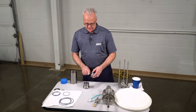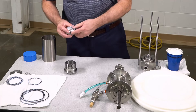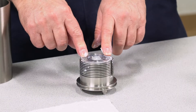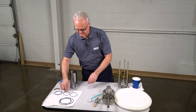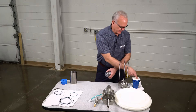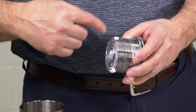Next I'm going to install this into the lower body. I want to put a coat of grease around that and around this surface. The reason is this piece slides into this one, and if I have grease on it when I assemble it, when I go to disassemble it I won't have sauce that gets pushed up inside and makes it difficult to get apart. This o-ring is a little smaller than the others — the smaller one goes here and I'm going to run my fingers around to make sure I've pressed it all the way into place. At this point I'm going to add grease again on the threads in about three places, on the first couple of threads, so when I thread it in it coats them.